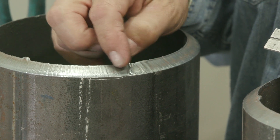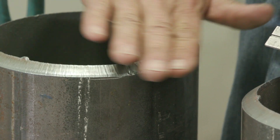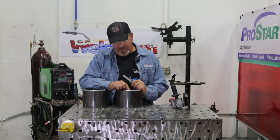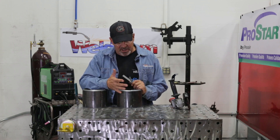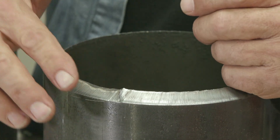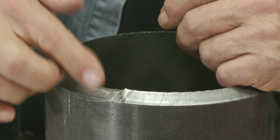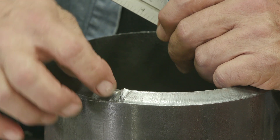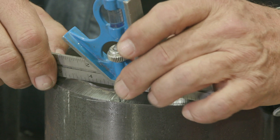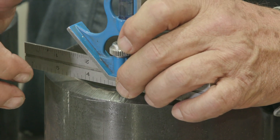I always leave a little ding in here — not super critical, and this one's not that bad, but I want to dress it. You'll see a depression in here, and this would be indicative of stuff I've gotten with fittings that already have the machine root face on them, got the bevel protector on them, but somehow in shipping something got hammered or dinged up on the end of the pipe. So here's one that's right next to a start and stop, and the man cub was playing with a hammer or something — we've got this dinged up pretty good.